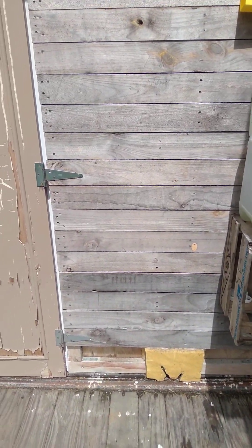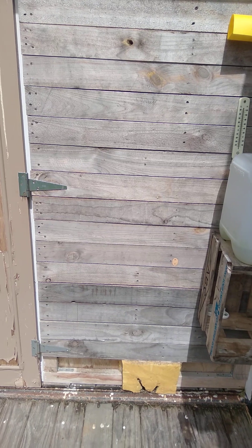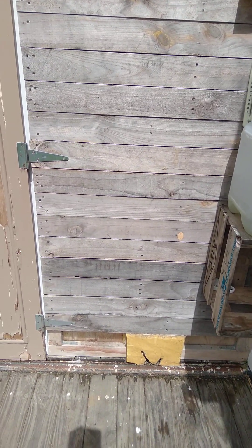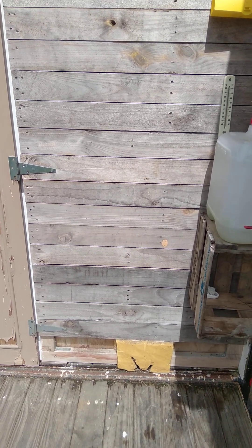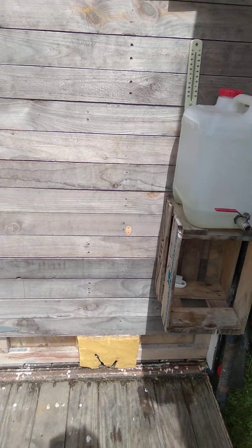This is the back of the horse float ramp. The shower head is plumbed down the back of this — it will freeze in the winter time and blow your mixer tap — so for about five months of the year I disconnect the hoses underneath the horse float at night and drain it out.